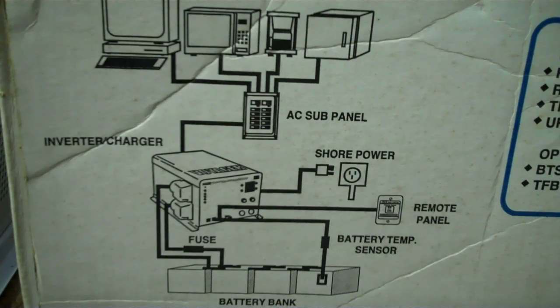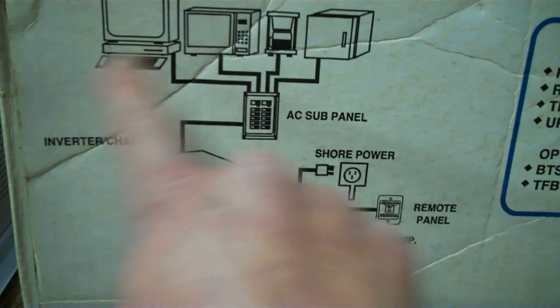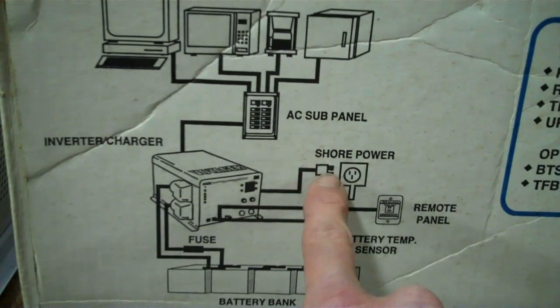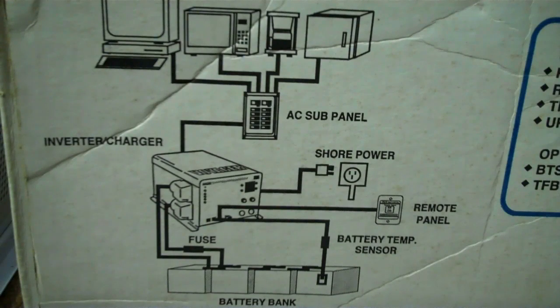Here's a good example of how you'd use an inverter charger for household applications. You have your regular power in, it goes out of the inverter through a sub-panel and runs your designated loads — whatever your inverter has capacity to run. Then you have your battery bank. This input can always be switched over to a generator; if you have a quality generator you can plug it in and it will charge your batteries back up. You'd add solar to feed your batteries, but you'd have to change the charging parameters so your solar can keep your batteries topped off.